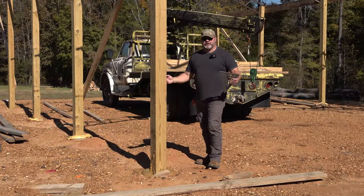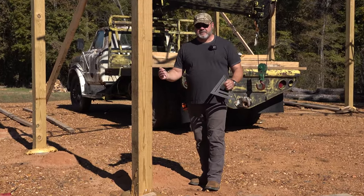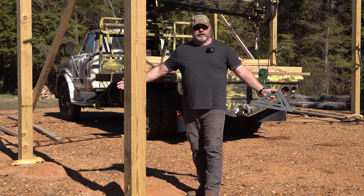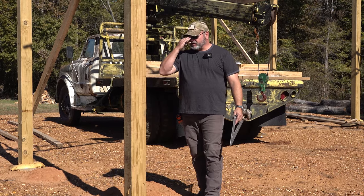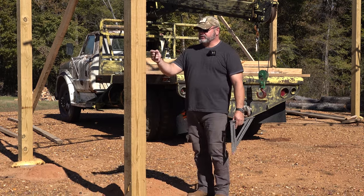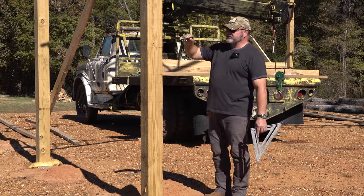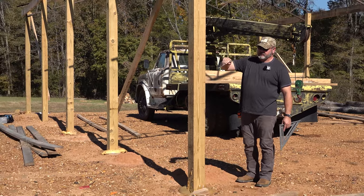All right, so making a 30-foot long laminated beam, I find is not easy because it's freaking 30 foot long. So I understand why it's so hard to build. So what I'm gonna do is use the pole barn. I've already have marks here that are level all the way down. So these are my starting points. These were shot with a laser level.